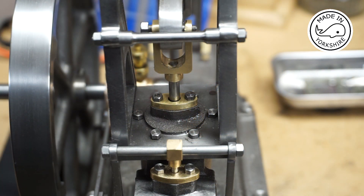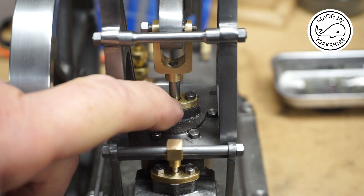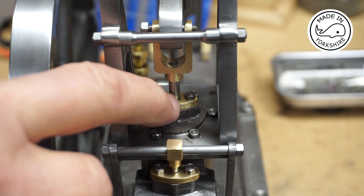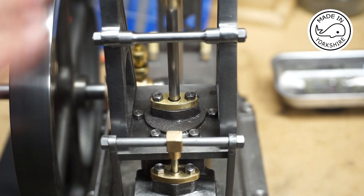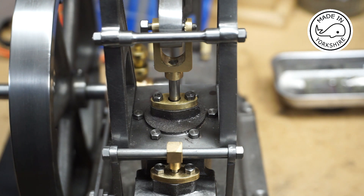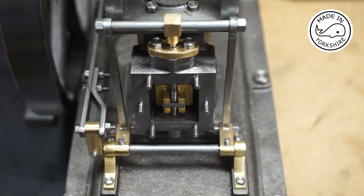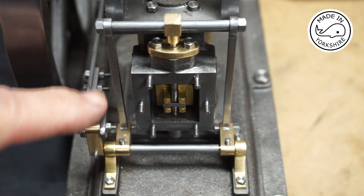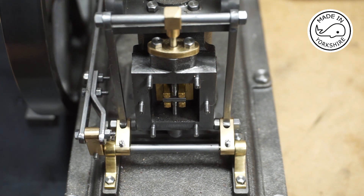Okay so I had a rethink overnight - it's good to sleep on things. And this morning I decided to just open up the hole in this brass gland bush very slightly, and it seems to turn OK now. So what I'll do on final assembly, when I put the gland packing in there, that can do the business. Now in terms of the valve assembly, I've just connected up the linkage. So I'm now at a stage where I need to be looking at the valve timing.